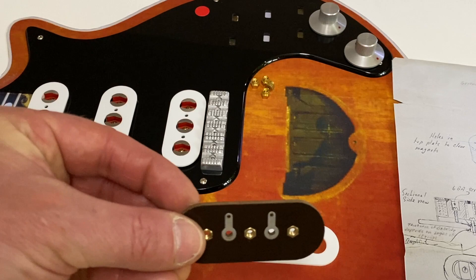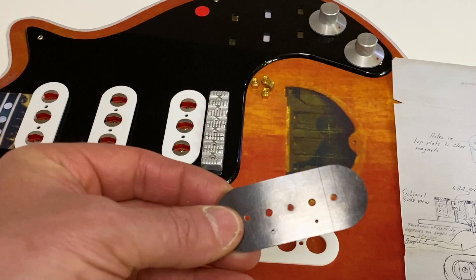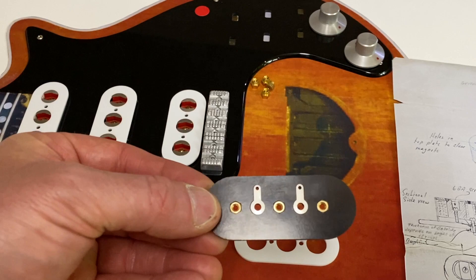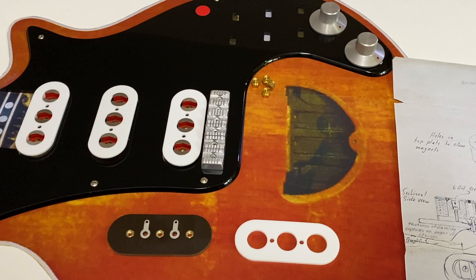The Paxilin is a brown phenolic paper laminate which has good mechanical and electrical properties in low voltage applications. The material is strong, rigid and economical, and ideal in applications such as terminal boards, mounting plates, bus bar supports and cable supports. You may have seen a set of these pickups fitted to the Red Special replica that Andy Guyton made to Brian's original specification for his 70th birthday in July 2017. That set was made by Ade Turner of Aderson Pickups. Julian Hemingway made a similar instrument some years previously and demonstrates them in a video on his YouTube channel. I've made these pickups to be as close as possible to the original design sketch in fundamental shape, size and materials, but with some minor differences.